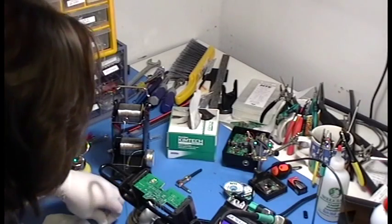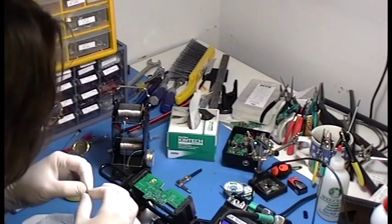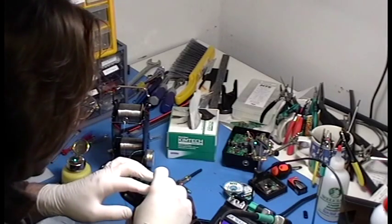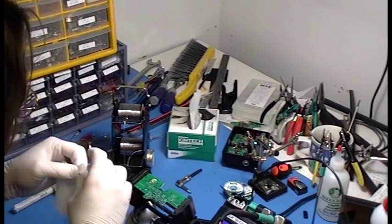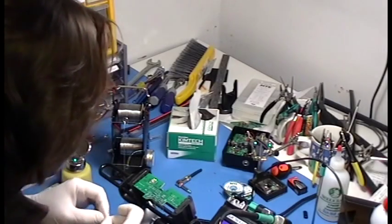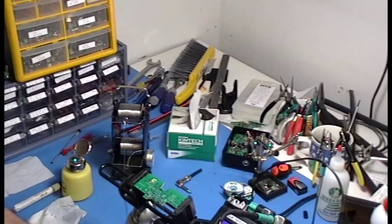What was I saying? Oh yeah, with these tiny little joints, even small amounts of grease and dirt and junk can screw you up. And in my shop, if the joint doesn't look good, you don't just say, it'll probably be fine. Which actually it probably would be fine. I know because I've been inside a lot of electronics over the years. You can make some shockingly bad joints that actually work, but it's just not what we do here. Definitely don't do that here. We do it right or we don't do it. So a bad joint like that would be a rework. It wouldn't be a fatal mistake, but it would be a rework, and that just costs me time. It makes a mess.